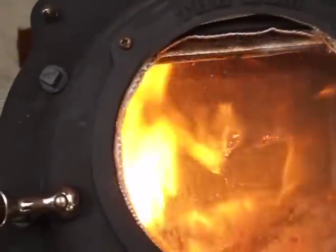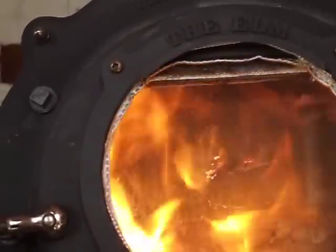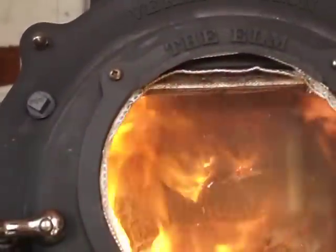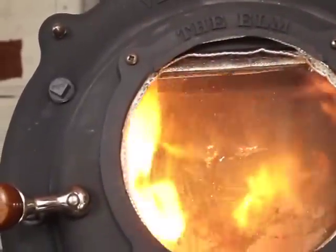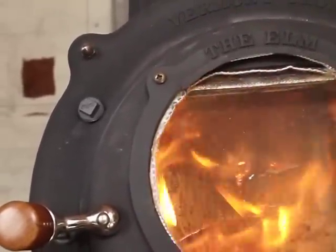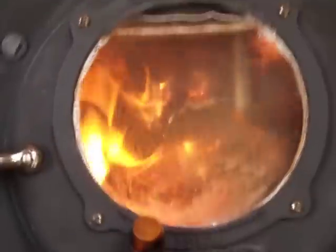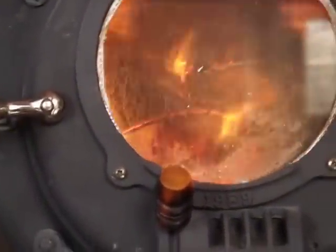It's fairly dramatic that the additional rows of flames are making for a hotter stove and a cleaner burn. Right from the very beginning there was hardly any smoke — I'm used to seeing considerable amounts of smoke for the first 40 to 45 minutes, but in this configuration the smoke was just being consumed by the secondaries.